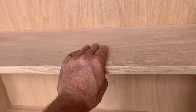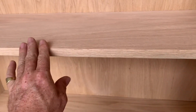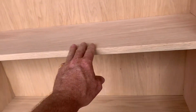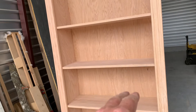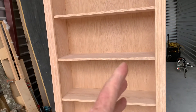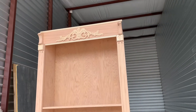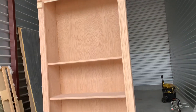It feels soft to the touch — it doesn't cut you, because when you cut this stuff it will paper cut you. It's actually deeper than a paper cut; it's really super sharp, so we rounded that. Not only that, it looks better. The shelves are not glued in — they're slid into the dados so they can expand, because they are solid oak. Everything's oak on here, except up here the trim is soft pine, but we think it's going to work out perfect.